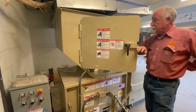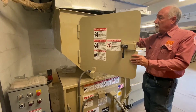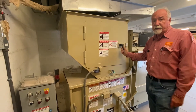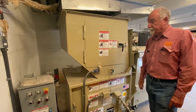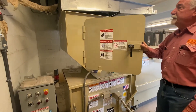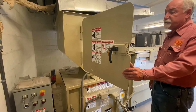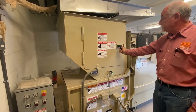This is just a door latch here for opening and closing. This is just for access, like if there's a jam or somebody wants to throw some trash in here on the ground. But you have to remember if you open this door you have to then reset the auto circuit, so you don't want to open this door very often. If for any reason there's a jam or anything in here, I would recommend locking out the disconnect so that it can't be automatically started. You want to make sure that all the safety things are done so that nobody gets hurt.